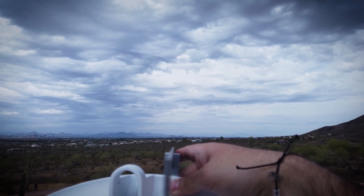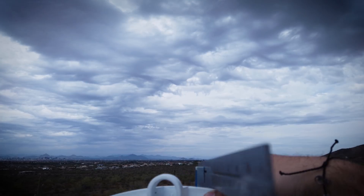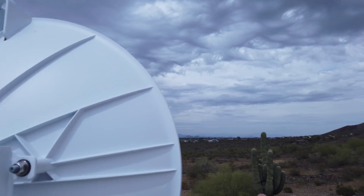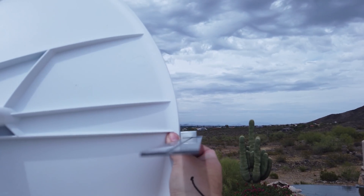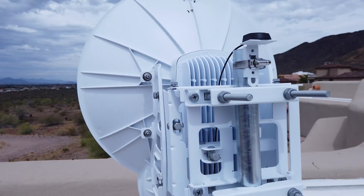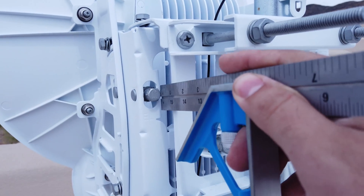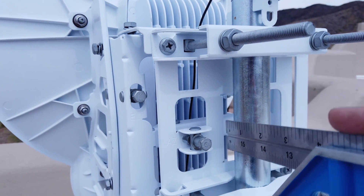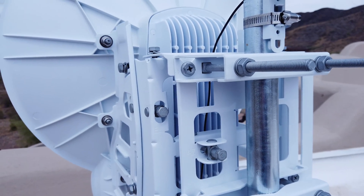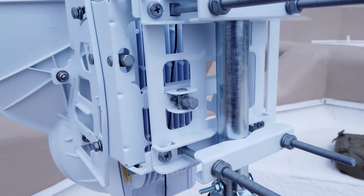So you can see this one's pointed right there, which is a little bit to the right of where we want to go. And then for elevation, you put it on here this way and you use it again as a sight, but this time to see that we're pointed into the dirt — so that's not really doing us a lot of good on this antenna. On this antenna you have your azimuth adjustment, which is your left to right, and your elevation adjustment, which is your up and down. You turn these different directions very, very slowly while you either have somebody on the other end of the link looking at reception, or you can plug into the data port and see what it's doing as far as reception goes.